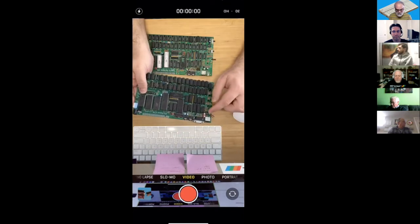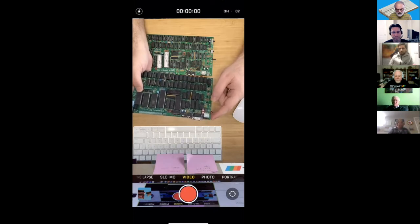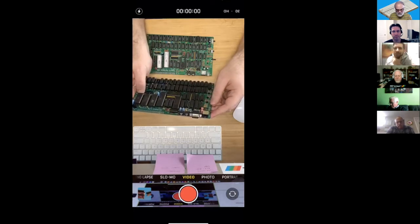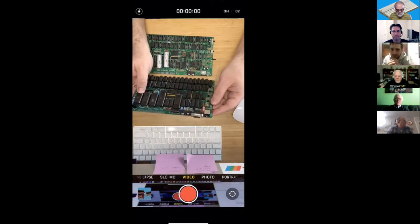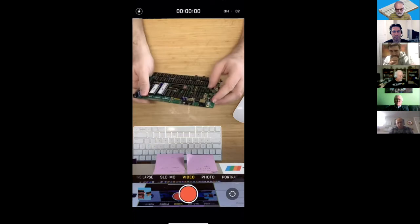And then the way that Don designed this thing generates the composite video. You'll notice that there's no RCA connector on here. The composite is actually coming out at the board edge on these two ports. RGB comes out through that funky little connector. I can't remember what this 9-pin is. It might also be video. I think it's that kind of PS2 connector, for S-video. Sometimes you use a cable that converts S-video to the SCART signal, or I'd have to go back to the schematic that he gives for it. And then this one has composite out and S-video. Yeah, that looks like an S-video connector.